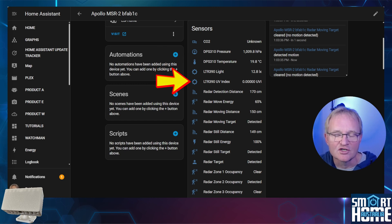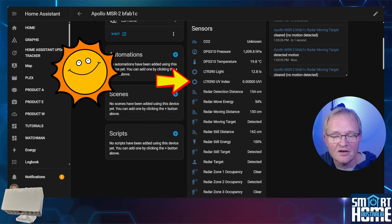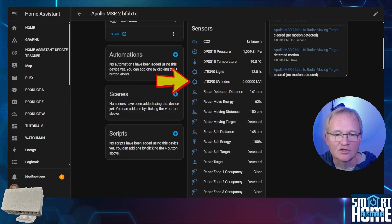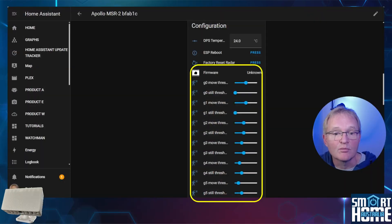Then comes the star of the show — the radar detection. Apollo excels at self-help guides, and heading over to the Apollo wiki site (links in the description) provides an in-depth tutorial on tuning your sensor. The radar motion tracking can be configured for three zones, distanced from the sensor rather than positional in the field of detection. In my testing, this proved to be very accurate. A good use case would be turning on desk lights when you're sitting at your desk but not when somebody simply passes by — detecting movement close but not far away.